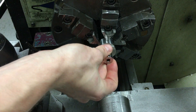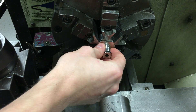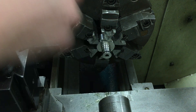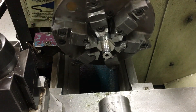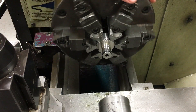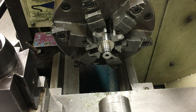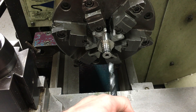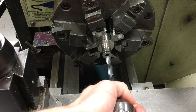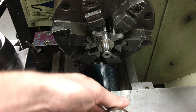We might have to part it and then rely on the thread that's already built in, which I found out adapts perfectly to a 1/4 inch NPT thread — and then we can just have an adapter from there. Here is our 1/8 inch NPT tap. First we're going to need to widen that hole to fit the tap. I'm recording this after the fact, and it seems everyone says to use an R size drill for a 1/8 inch NPT tap. The chart in my shop said 11/32nds, so that's what I used — a little bit bigger, but it ended up working just fine.